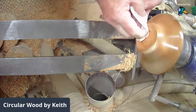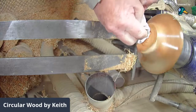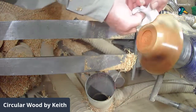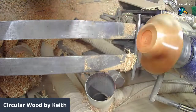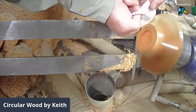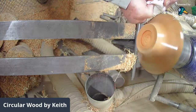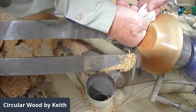The lowest your lathe will go, within reason. Mine goes down to 2, but 2's a little bit sedentary. So this is about 60. Could spend all afternoon watching it. Yeah, I've worked it in, so I can now knock it up a bit. We're going up to about 250 now. The more time you can waste, you can actually feel and hear the paste working.